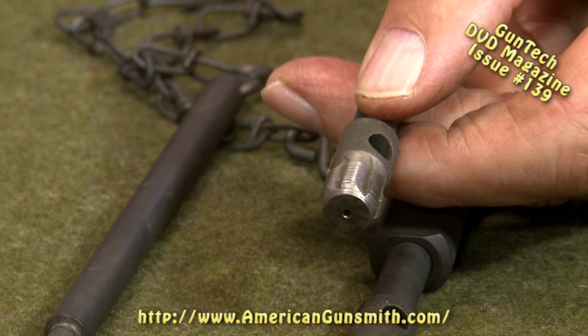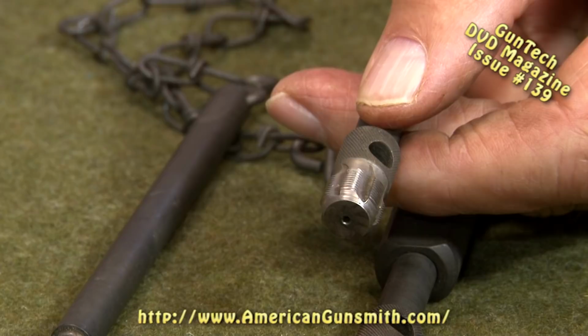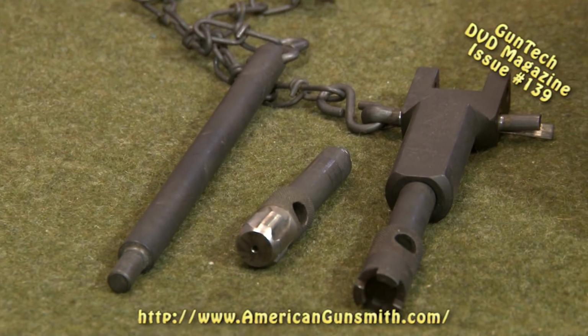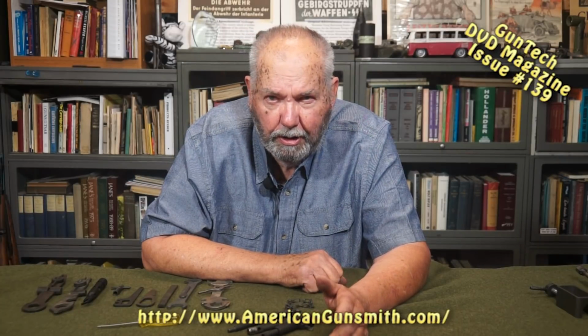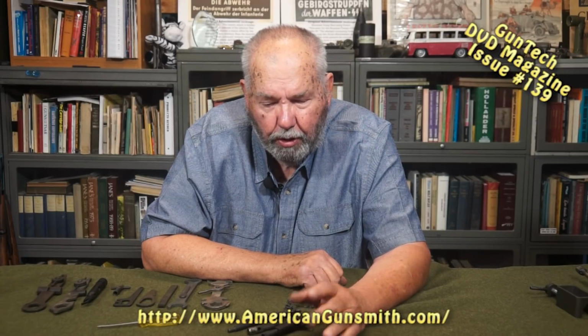The tap goes in, cleans the threads up. That's why it's called a gas cylinder reconditioning tool, because that's what it does. And frankly, if you've got to do it, I've saved barrels that somebody has messed with, they've messed the nut up, there's any other issues that they've developed while they did it. So what you've got here is a tool that'll correct it.